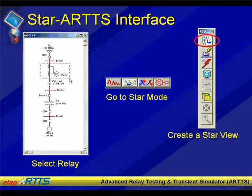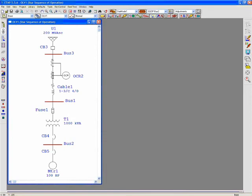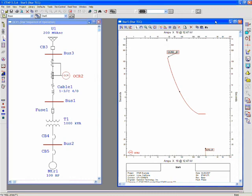I'm going to switch to the ETAP environment and walk through this with you. Here I have an example file provided with the demo version of ETAP, called the STAR Example. We have a simple system consisting of a utility with a relay feeding a motor through a transformer. Today we want to test this relay — overcurrent relay OCR2 — to see what the manufacturer-published data is versus the actual relay testing. I already have some previous test data for comparison. I'll show you those first, and then we'll go ahead and actually test the relay using simulated testing. I'm going to open STAR TCC. The device coordination program in ETAP is called ETAP STAR — in ETAP STAR, you can provide...